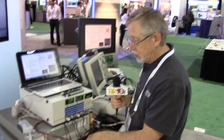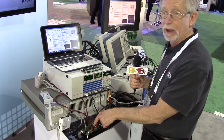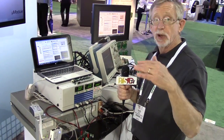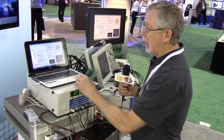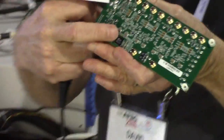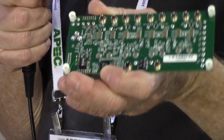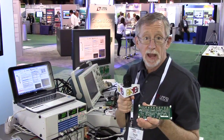This first chip here is a 2x9 amp output. The next one is 2x13 amps. The next one is 2x18 amps. So we have kind of a stepping stone of currents for whatever output you need. We also have what we call a dumb chip — this is also 2x13 — which doesn't have PSM capability. So what we do is add an external chip that bolts onto the side, and with that we can take an existing design and give you PM bus or power system management capability.